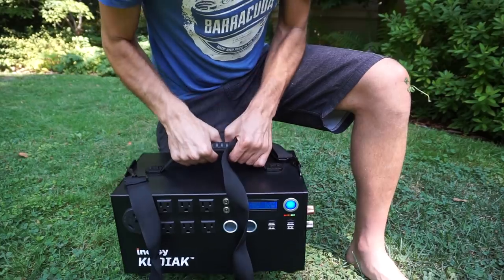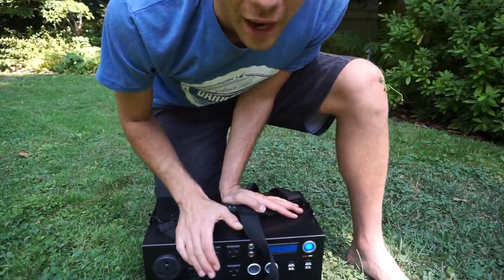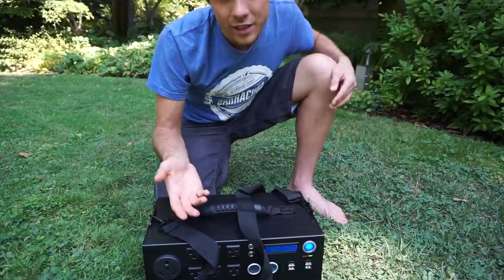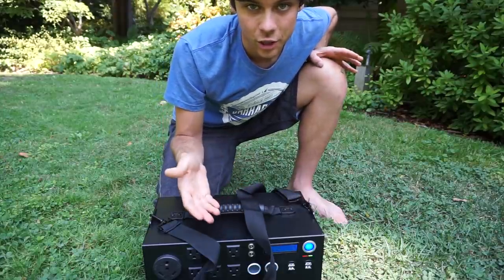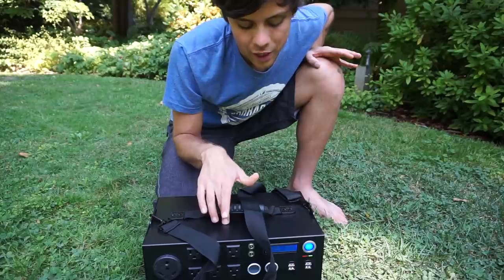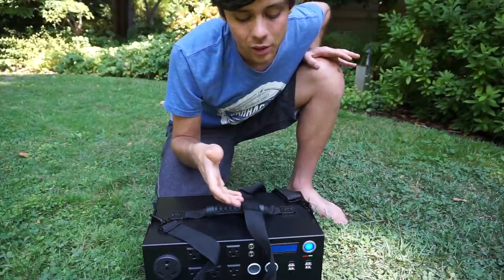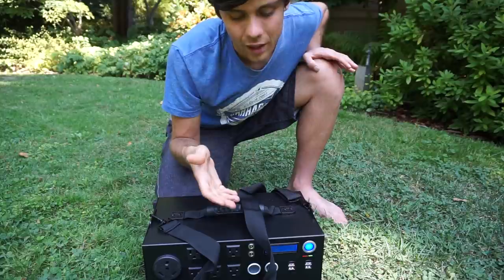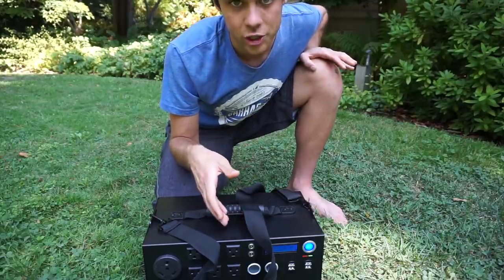The size and weight are impressive — it's small and light, fits in a minivan. My old RV battery bank was over 200 pounds of VMAX lead acid batteries with 310 amp hours total, but only the same usable watt rating as this Kodiak since you can use 100% of the lithium but only 30–50% of lead acid. Lead acids get about 500 charge cycles while this gets 2,000 plus — potentially 5,000 with partial discharges. It's comparable to a lithium iron phosphate battery due to the charge circuitry, likely charging to 4.0–4.1 volts per cell rather than the full 4.2 volts.